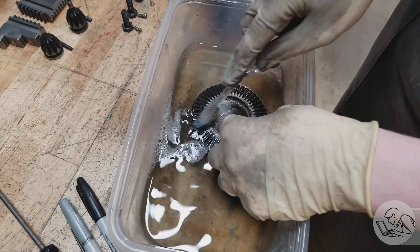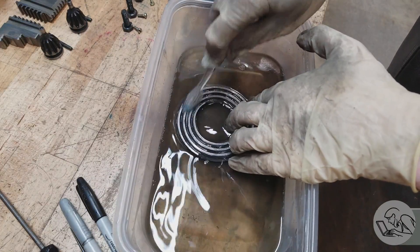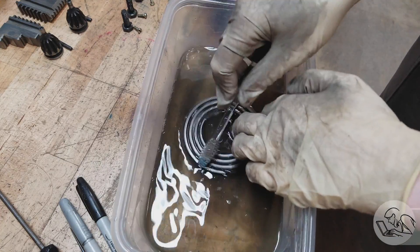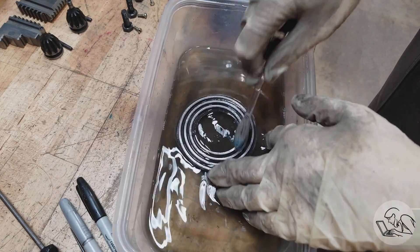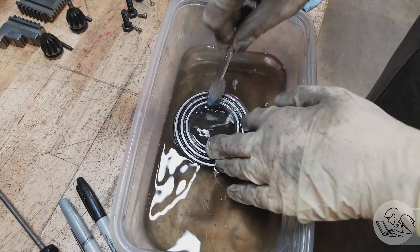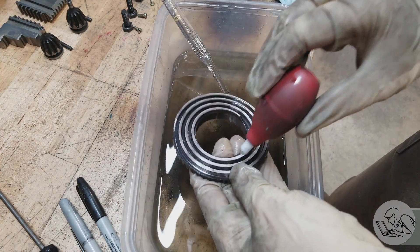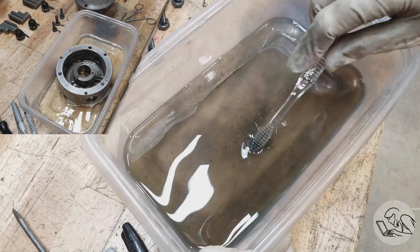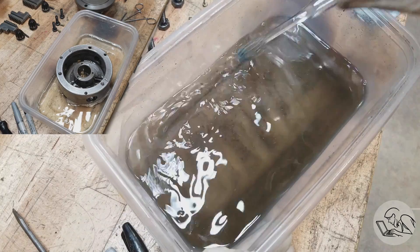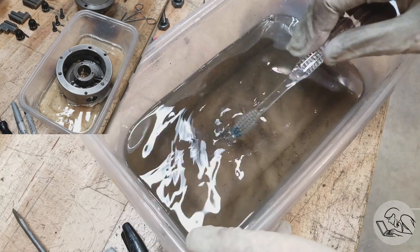While you're in here, it's a really good idea to do some deburring. On discount tooling, deburring is one of the primary ways they cut costs, so nothing is ever deburred. A little bit of time with a file and some deburring tools goes a long way to improving the feel and smoothness of the chuck. Don't forget the pinion holes as well. Getting busy with the pinion gear now — this is likely where most of the chips are living, especially the front of the scroll which is exposed to the elements and takes the brunt of the chip spray from every operation. This chuck didn't look that bad but a little before-and-after shows the truth — quite a lot of crud came out of this chuck.